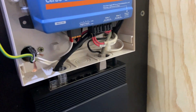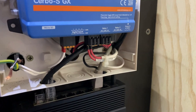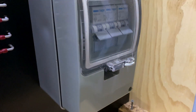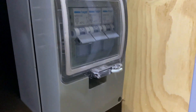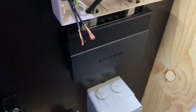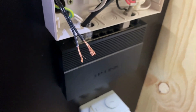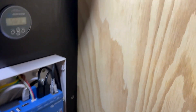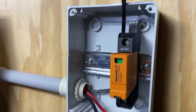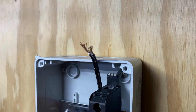The other end we're going to digital input 2, and I've connected that red cable onto the bottom side of those circuit breakers. I'll crimp on bootlace terminals to the rest of the cables now. Get them all terminated into the surge device, into the servo.